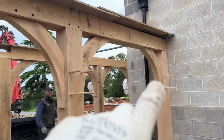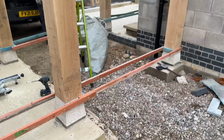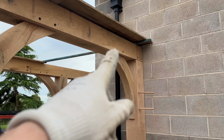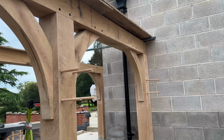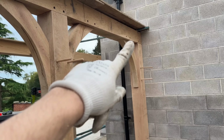It's going to sheet it to stop the water getting on the beams. So we've screwed some battens around the corbels, around the staddle stones, and put some boards on the top just to wrap a tarpaulin over and then fix it in along the bottom. Hopefully keep a bit of air flow through them so they don't go mouldy, but stop the worst of the water getting on, so all this top section doesn't get water marks all over it. And the same down this one here. Bit of effort now, but hopefully it saves a lot in time.